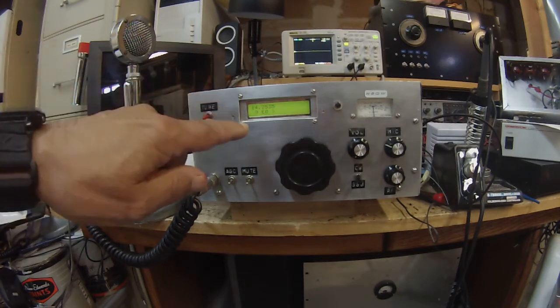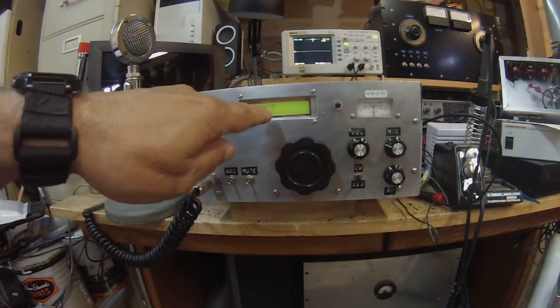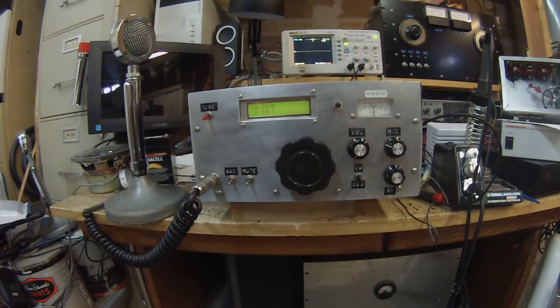It's one band only — 20 meters. You can see it's at 14.235 and it's not moving. That little caret moving back and forth shows how much the stabilizer is always monitoring and changing so the frequency is locked on. The VFO enclosure was something I originally used in my LM373 transceiver — that's the second build. The first build was in the 1970 timeframe, and this enclosure, which is one-quarter inch aluminum plate, was used with that rig. Pretty heavy-duty — we liked it very much.